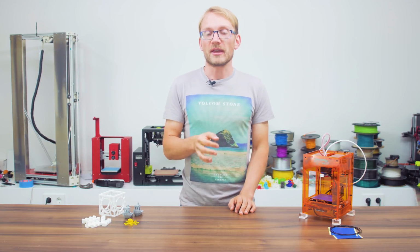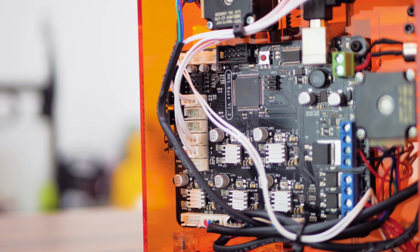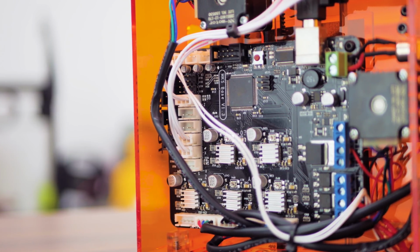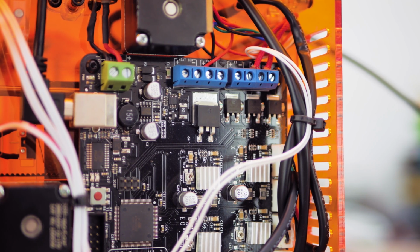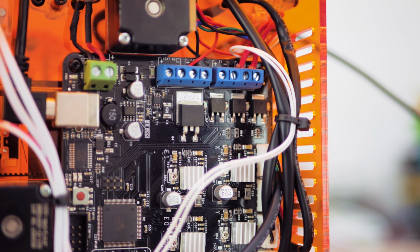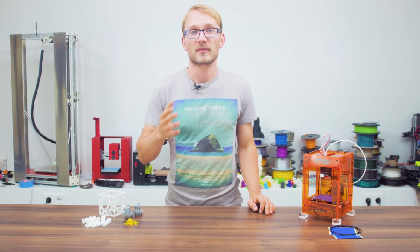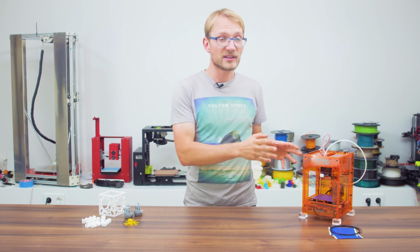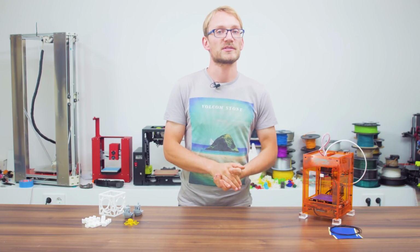Also surprising to see here is the fully featured MKS Base version 1.3 mainboard. 5 stepper drivers, 3 power outputs, a heated bed output, and as expected for a cheapish board, standard Allegro stepper motor drivers and zero consideration for component current limits or any sort of failsafes. Ironically though, now my smallest and my largest Cartesian 3D printers use the exact same mainboards.